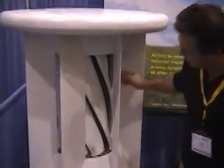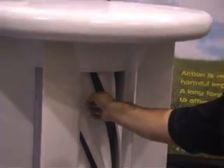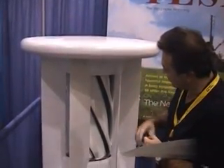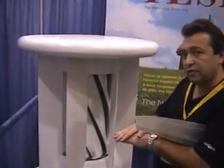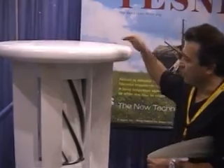Here on our turbine we have a stack of 200 discs, stacked one on top of the other with a very narrow gap of 2mm in between. When the air leaves the trailing edge, it enters in between the gap between the discs, sticks to the surface of the disc, and pushes even further the rotation of our turbine.